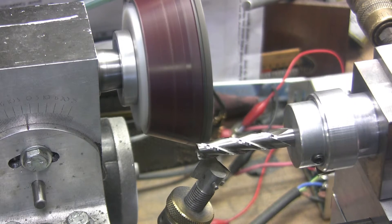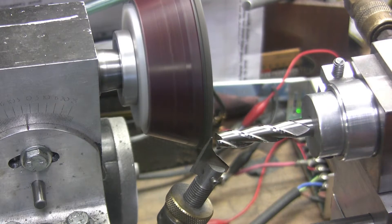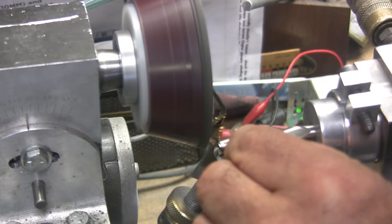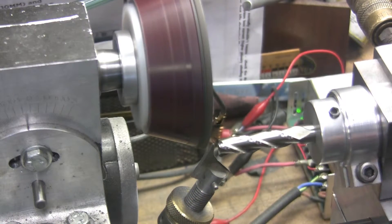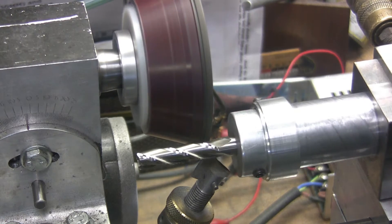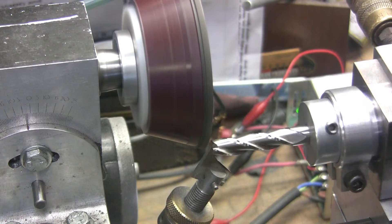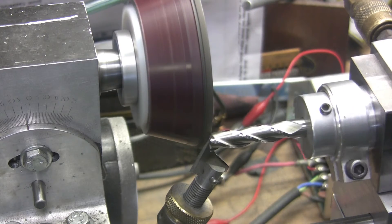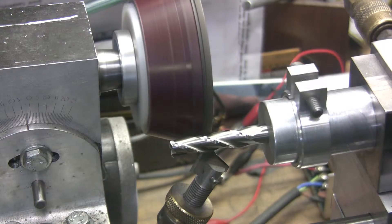Was that the last one? There was a track here. Let's see what we've got here — a little ragged, just in one spot. I'm going to take another mark. This one definitely should have the secondary ground on it too. Naturally, I pick an end mill that's really chipped up to video. Otherwise, if they're not chipped, it only takes about 10 minutes and you're done — not even 10 minutes.